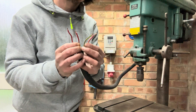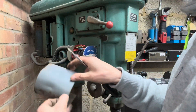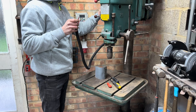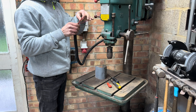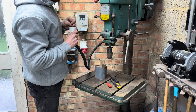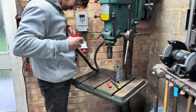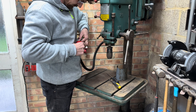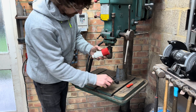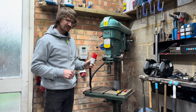Our first task here is to work out which wire is being used for each phase. Normally these will be either colour coded or numbered, but with this machine being a bit of an old timer, we have to investigate and work this out for ourselves. Luckily, this is a pretty simple job and only requires us to find where the cables are running to, give each one a yank, and see what moves at the other end. Now we have our phases quickly labelled, we can get this plug wired up. Now that our plug's on, I'm going to give it a quick plug in and see what happens.